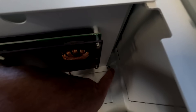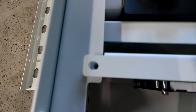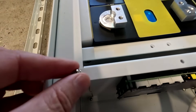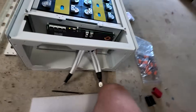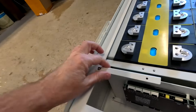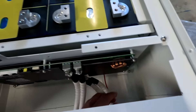With the BMS plate, I have put this screw in here and the other one on this side. But the top holes are still not lining up. I can push this over a bit so one hole will line up, but this one here is still out of spec. This one is not going in, so I probably have to force it in with a battery drill — potentially destroying the screw or the thread in the battery case. Okay, I think it just fit. Maybe the whole box is not really square or something. I don't know what's not lining up here, but it is in now — as good as it gets.